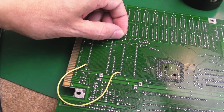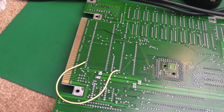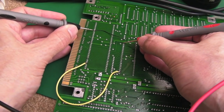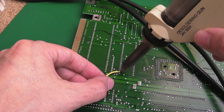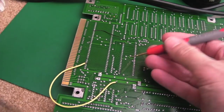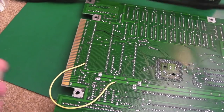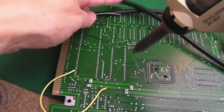One thing I'm just thinking — I could have tested these wires. Let me just get the multimeter, because if there's a join between here and here you don't need the wire, and I didn't do that — I was measuring from the top of the socket. Measuring from the top of the socket is not the same as measuring from soldered points. Can you see we've got a join there? So let's remove this one — I reckon this one will be joined as well. I think it's the socket that's the issue. Whether that's going to allow it to boot, and whether there's another fault remains to be seen — because we've already found one faulty CIA. That one's joined as well. It's one of these with multiple small issues.